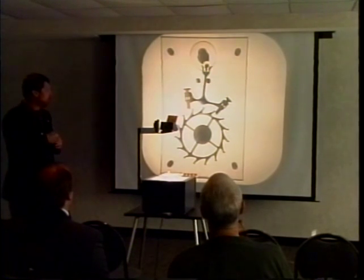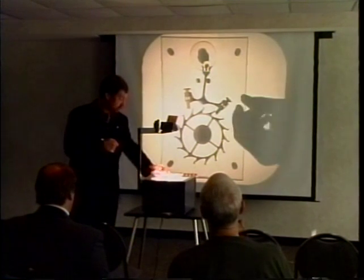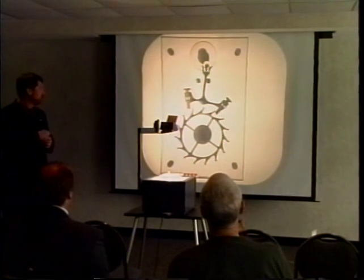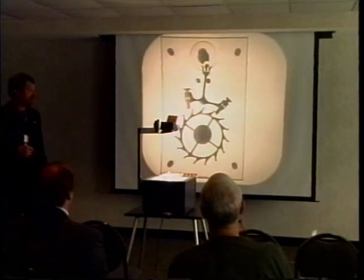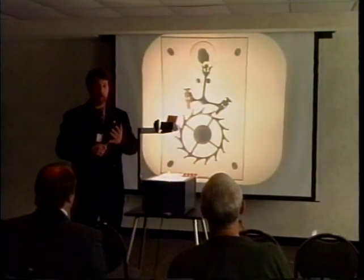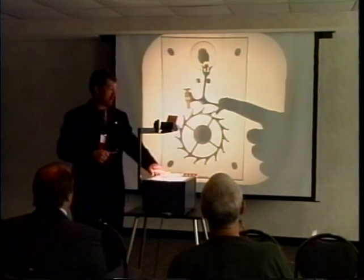And then when slide does take place, we're up against the banking pin. That means that the lock between the pallet stone and escape wheel tooth is as deep as it can get, and total lock has taken place. Now, if we pull this stone out, how does it affect drop lock, slide, jewel pin clearance, and total lock on the L side?